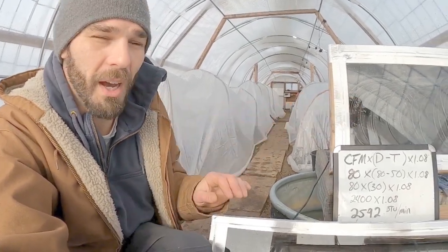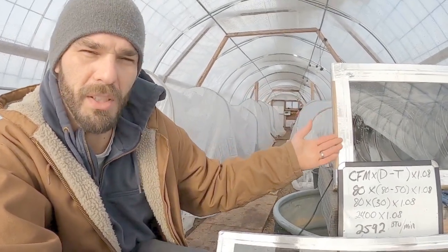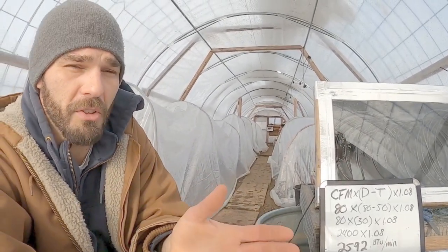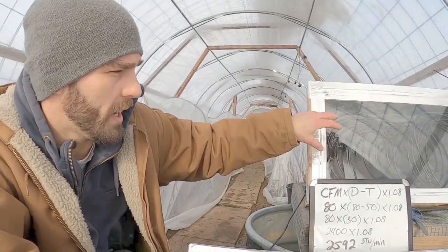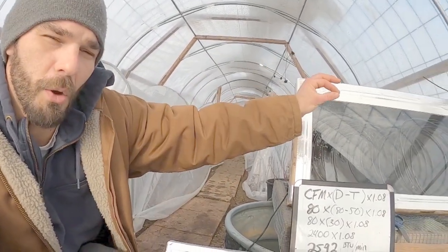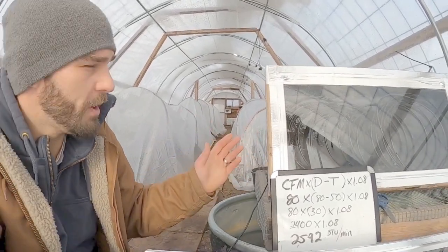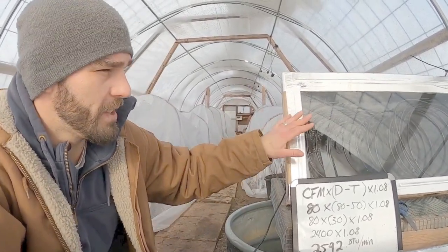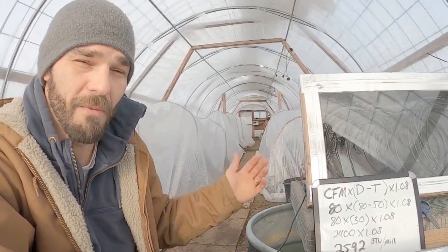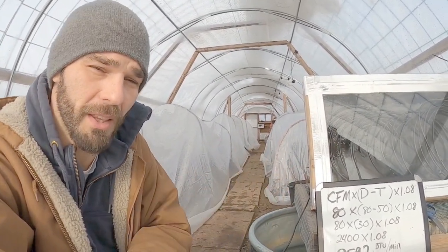The solar water heating box is already clouding up because I had it running for quite a while and it's losing its heating potential. If we're just purging and running this every half hour, we're getting a lot more energy put in because it has time to store and heat all those coils back up before that water flows through. So if we either slow our water flow rate or purge it on a timer, we'd be achieving much better temperatures — having 88 degrees coming out of this box is very very cool. That's a lot of energy being put in simply from passive heat by the sun.